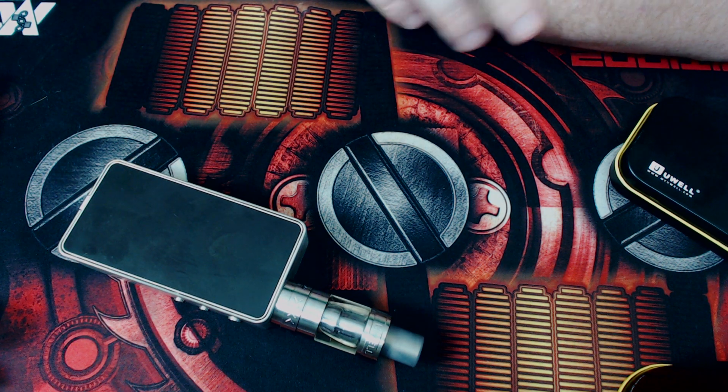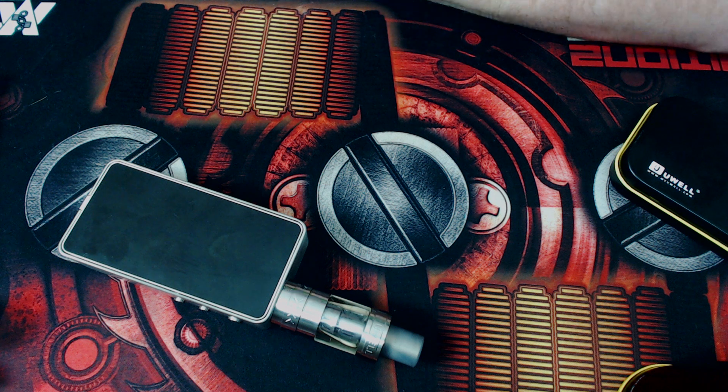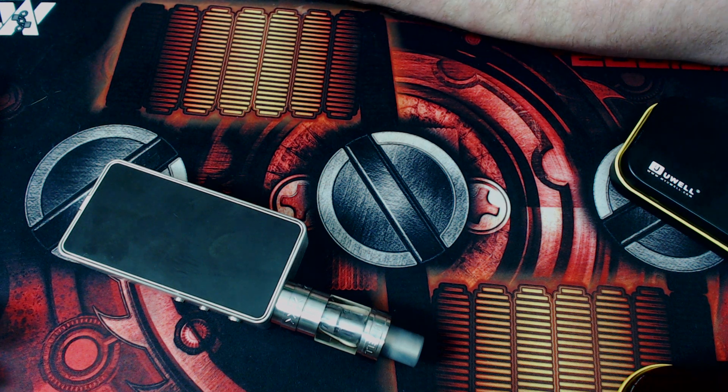So that's the close-up. I feel perfectly comfortable going into pros and cons. I've really been enjoying this sub-ohm tank. Flavor and vapor production — I'm going to compare it to the Crown since it's the same company. Vapor production on this is ridiculous. I get massive vape production because of the inner diameter of the coil head and the massive airflow on the bottom. Now, if you're going to have more airflow on a tank, you're going to sacrifice flavor. Close it down to about a third of the way and I get almost pretty much the same flavor as the Crown tank. It does get a little hot if you chain vape it. I'm using it at 110 watts.